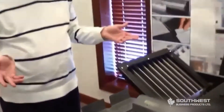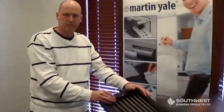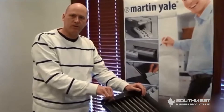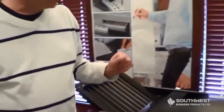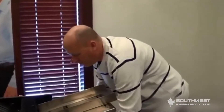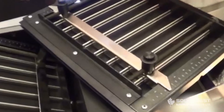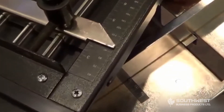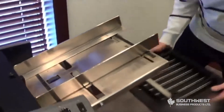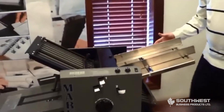A lot of times you will be dealing with stock that is not perfectly square cut. In that case, you need to adjust your fold stops independently for non-square paper — that is what these two knobs do. They give you micro-adjustment on the paper stop from side to side. For the second fold table, pull it out to set it — it was set up for a letter fold before, and the second fold on a Z and letter fold are exactly the same, already at 3.67 inches. Reinstall the second fold plate and your machine is set up and ready to run 8.5x11 in a Z-fold configuration.